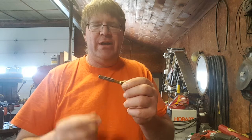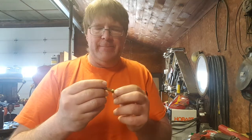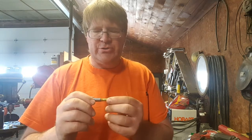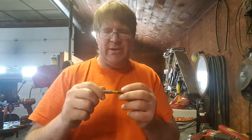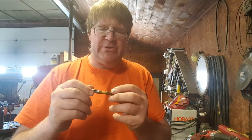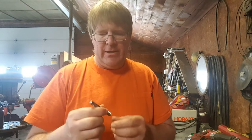But they aren't the greatest hand forming tap. I guess they aren't bad. They're no harder to turn than the hardware store ones. The big downfall is they're not made for everything. You can't use it on cast and some of those other grainy type materials that don't form very well. So that's their downfall. But they can run at a machine shop.